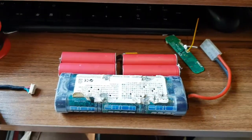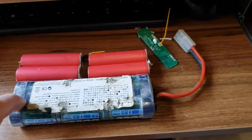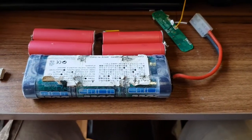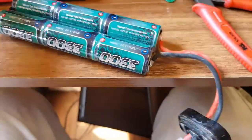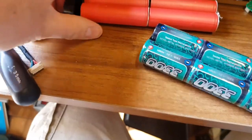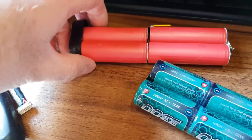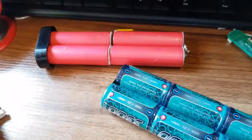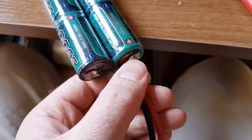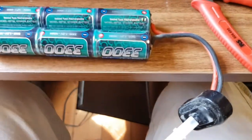So it should fit, hopefully. I wonder if I can take this apart and use these end covers. So this battery has now been peeled. The covers on the bottom are just plastic and they fit but they're very loose, so maybe I could pack them out with a bit of tape or something — I'm still thinking about what to do there. But I can get to this end and desolder the used wire terminals and actually get this connector off, so that was worth doing at least.